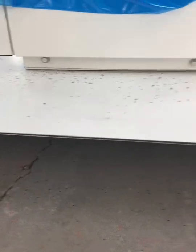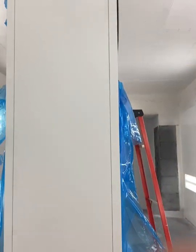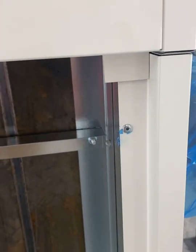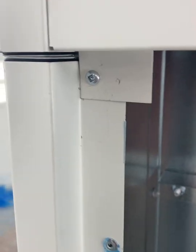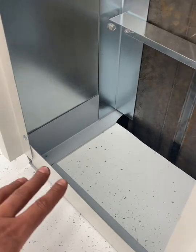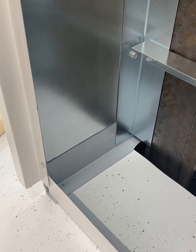After you're finished with the screws in the bottom, proceed by following the next steps on the other side of the column. Start by peeling off the face skin and sliding it up into the top channel. Screw both locations like the other side, and slide the other panel behind. When screwing these in, make sure to keep the screws as close to the outside edge as possible. Remember to fasten this bottom trim down before putting the bottom panel on.